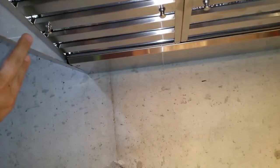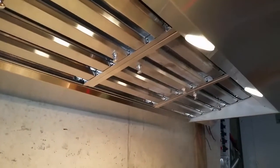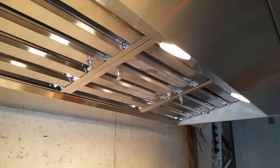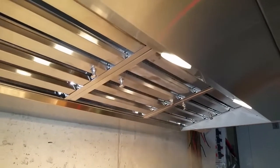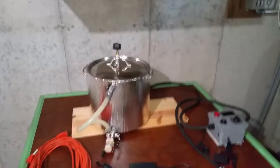This is a Type 1 hood designed for grease and smoke; a Type 2 condensate hood is really what I should have. The good thing is it does have a lip on the sides where condensate drips into a small pan. The only thing missing is a drain where condensate can exit — whatever doesn't get drawn up into the fan. My plan is to test this for about 20 minutes and see exactly how much water collects inside.